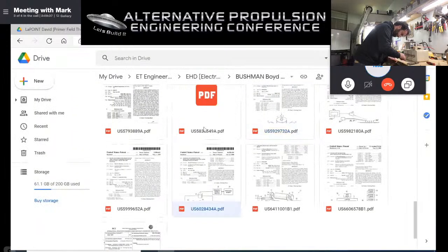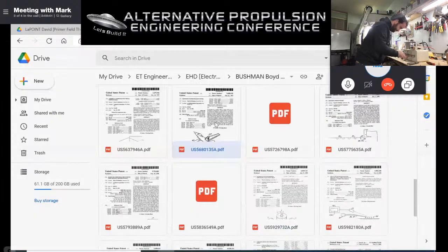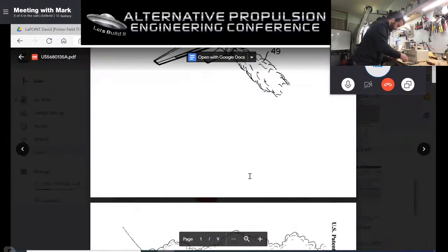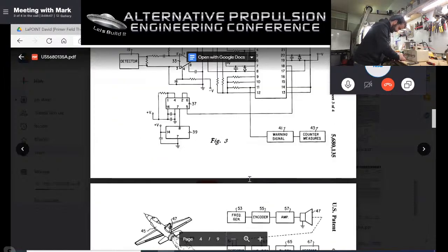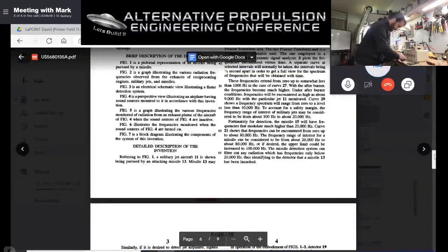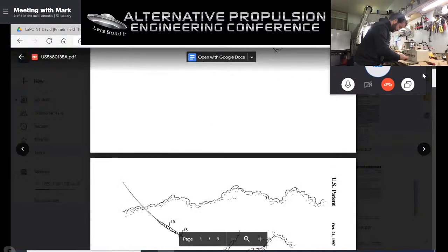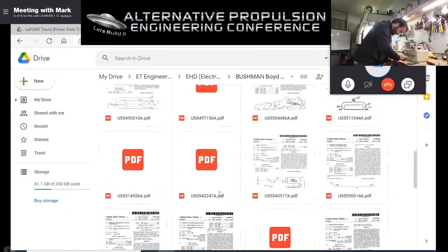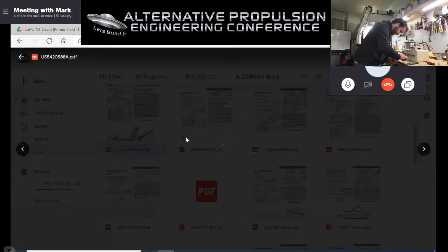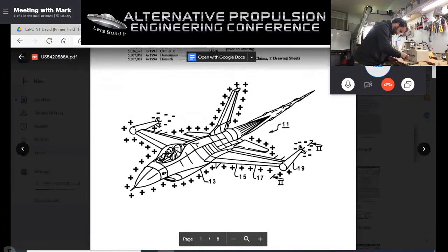Alrighty. Can't wait to try it though. That'll be fun. Okay, right now I'm cleaning up some copper over here. Copper wire to connect the capacitors to the spark gap. Excellent. I'm going to use the same 13.5 gauge wire that we're using for the coil. Might as well.